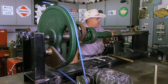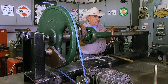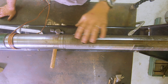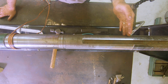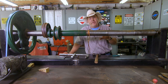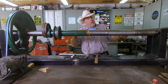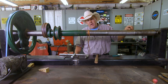A couple of challenges are figuring out the correct rotation speed to get a real nice bead and making sure that every bead overlaps the next bead by about a third. I'm going to weld this in short arc — we're going to use solid .035 wire with 75/25 gas. We're not looking for a lot of penetration; we want to penetrate into the base metal but we don't need to go super deep because we're going to machine most of this back off anyway. We need about 10 to 20 thousandths depending on the different worn areas. The shaft will be turning uphill, so it's like doing a downhill weld, but the weld will come to the top and have time to solidify before it starts the downhill side.